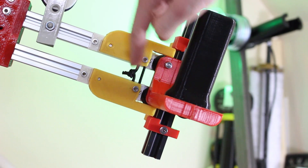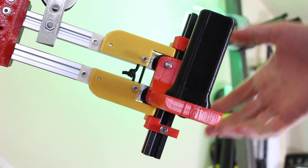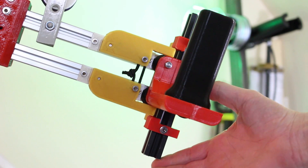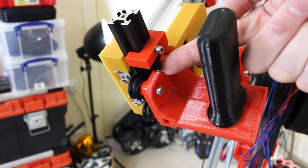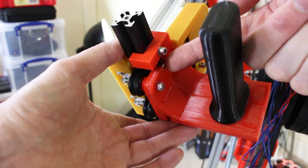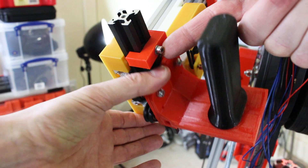Those are now fitted. There's bungee springing them together in the middle so they're sprung to each other but can't close any further, which means the slider always centres in the middle. You can just see the magnet placed in the slider which slides up and down, and we're going to fix hall effect sensors on the end stops in each direction so I can measure the distance.